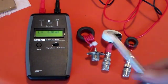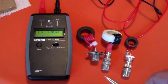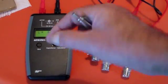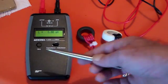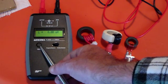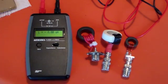Now this little button, I was saying it's disappointing that this doesn't actually protrude through the case. I've thought of a fix for that, and because it's Sunday I won't be able to do it today, but when I'm out and about tomorrow I'll stop off at the local electronics shop and pick up those little sticky rubber feet that you put on project boxes. You usually get 4 on a pad, and you just peel the bottom off and stick them on. I thought there's probably one that's pretty much exactly that size. So I'll stick one of the sticky feet on there, and then I'll have a nice rubber button protruding through the front panel.